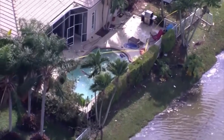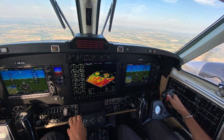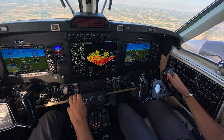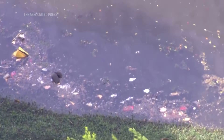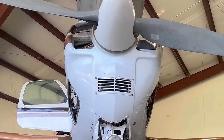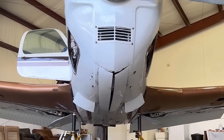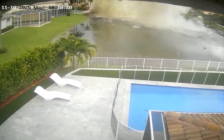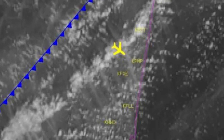Right now, this remains a preliminary report — there are more questions than answers. But there are a few very specific things investigators will focus on as this case develops. One of the most critical pieces of evidence is the pitch trim actuator itself. If enough of the stabilizer system can be recovered, investigators may be able to determine the trim position at or near impact — a stabilizer set near full nose-down would strongly support a trim-related event. They'll also be looking closely at maintenance records, especially surrounding the avionics and autopilot installation, since modern autopilots interface directly with trim systems. Rigging, calibration, and redundancy checks all become relevant with a stabilizer-based trim design. Investigators will also consider the human factors side — not in terms of blame, but capability: how much time would a pilot realistically have to diagnose and respond, and were there any cockpit cues that might delay recognition by just a second or two? Because in events like this, seconds matter.